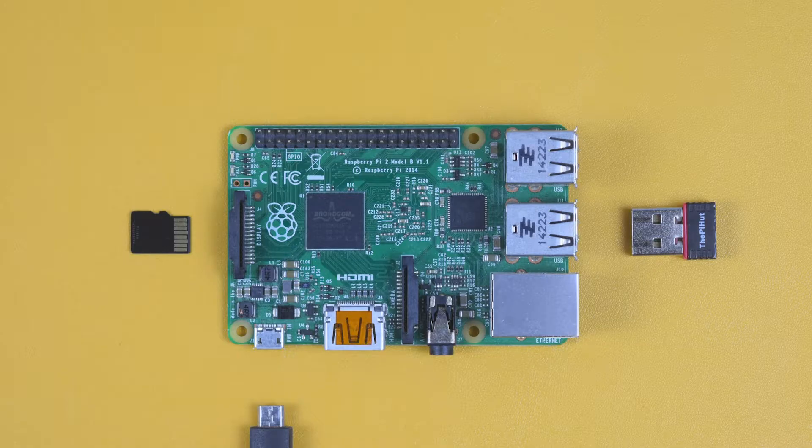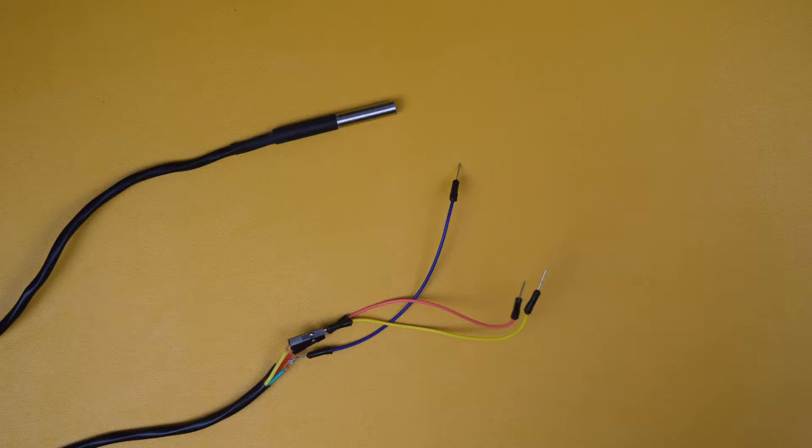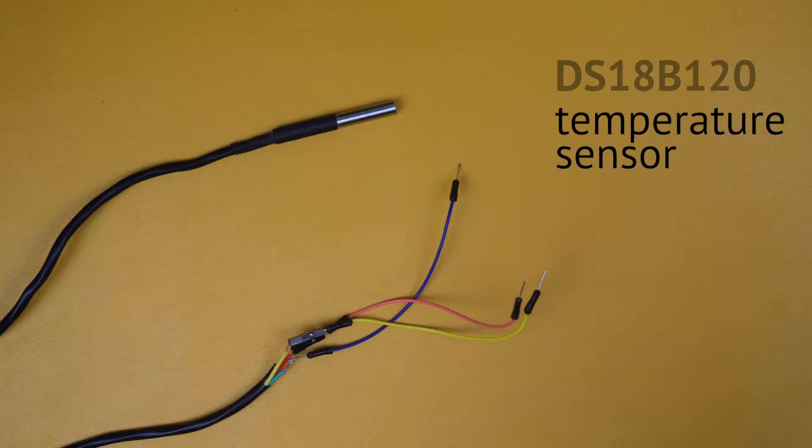And to keep on the DIY trend, the first component we are going to require for this is a Raspberry Pi 2 which we had laying around. In the description down below there is a link to a guide that you can follow step by step if you want to take things slow. Let's head to the prototype board. The sensor we are using is a generic and cheap version of the DS18B20 sensor that is also waterproof. It is a very easy to use sensor because you only have a one-wire mode connection to the Raspberry Pi.